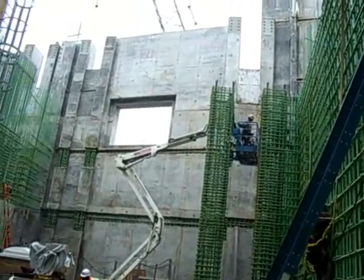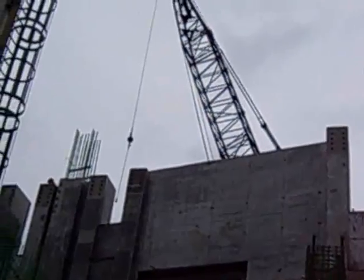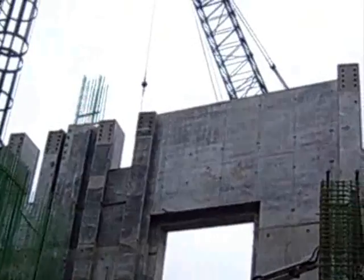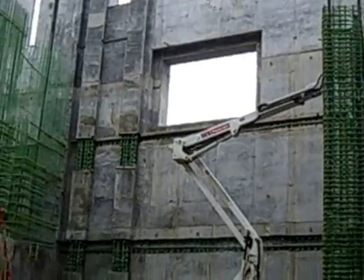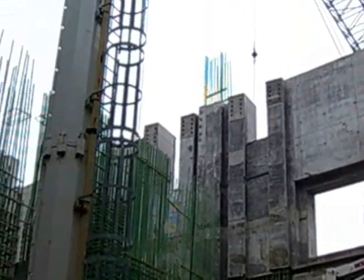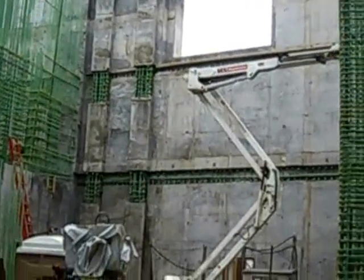On top of that is where the large trunnion is going to go across. And if you look, you see the opening — the slit that's in the wall there — and on the other side, that's the place where the bascule is actually going to work, and it's going to pivot on that point. Where we're standing right now is where the counterweight is going to be, so it gets evenly balanced across the trunnion. The same amount of weight will be placed in the counterweight as the roadway section of the bascule, so it lifts nice and easy — that's how it works.